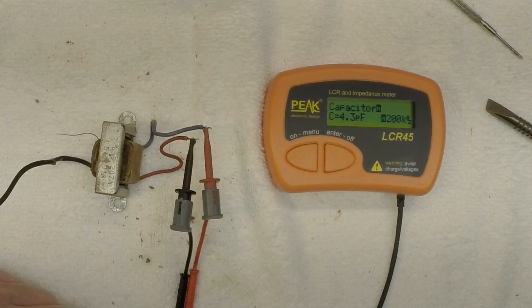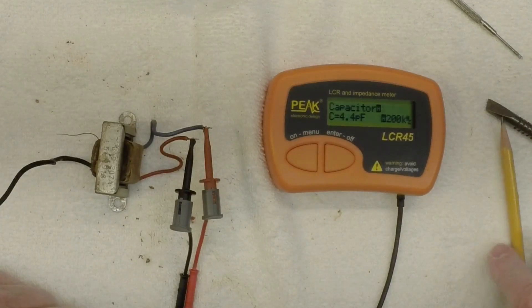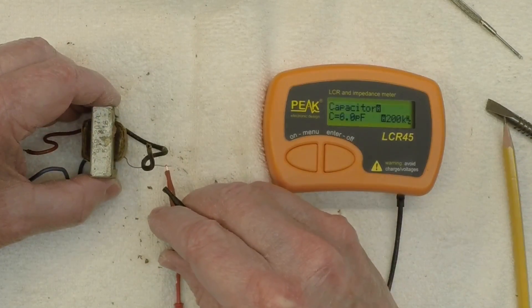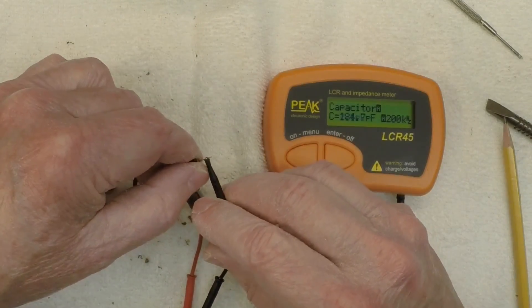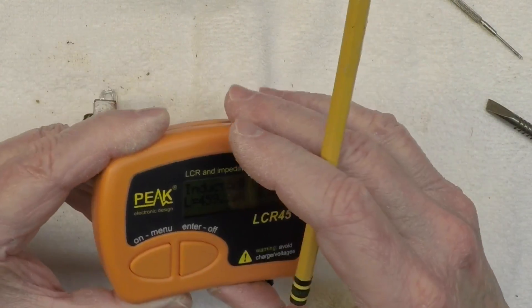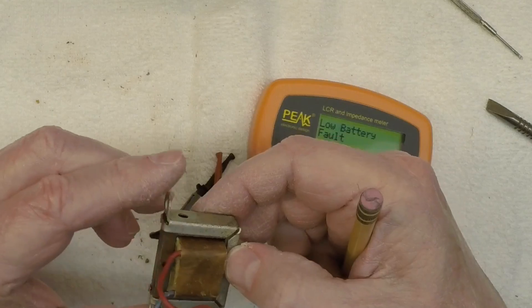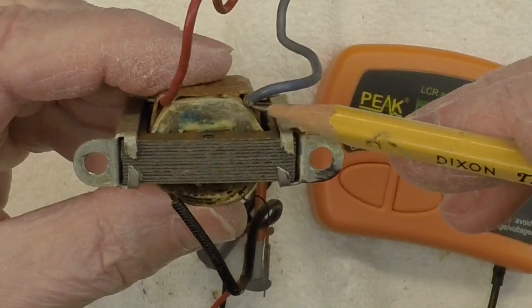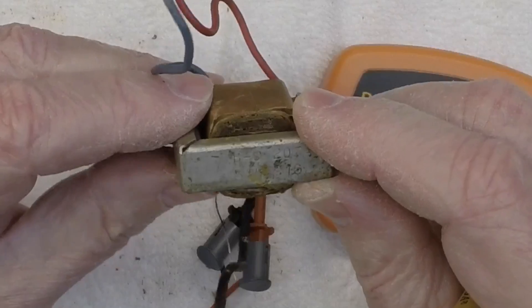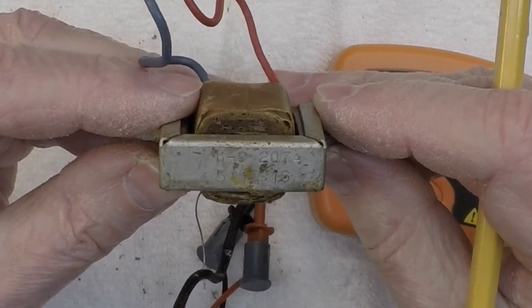Let's do some measurements now and see what we have. In auto mode, you can see it's showing as a capacitor — 4.3 picofarads. So definitely open on the primary side as we previously measured. Now we'll see if we can get a good connection to the secondary. The secondary looks good at 0.62 to 0.63 ohms. So the problem just resides on the primary side — probably what took this little airline out of service. Everything looks nice and neat going up underneath the paper wraps. We'll pop this thing open and see if we can discover any damage on the primary side that's worth fixing.